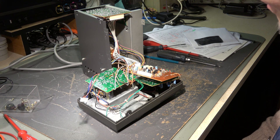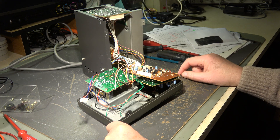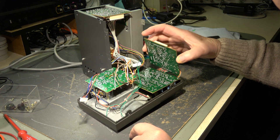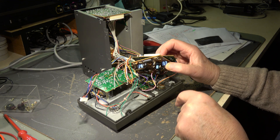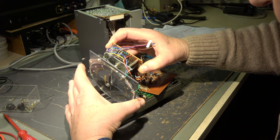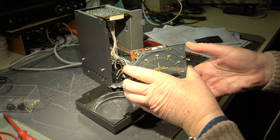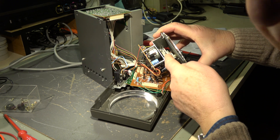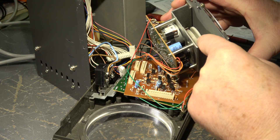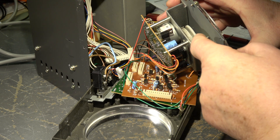It's not as easy as I thought. Access to the wheel on one side is not directly possible because one of the shafts goes through this wheel. So I have to disassemble this unit to get access. I have to unplug everything, unmount these four screws, then I have access to these four screws, and then I can flip this unit out carefully. Here we can see the problem — not on this side, on the other side. This big wheel has an axis which only ends there, but this tooth wheel has to be removed to get access.